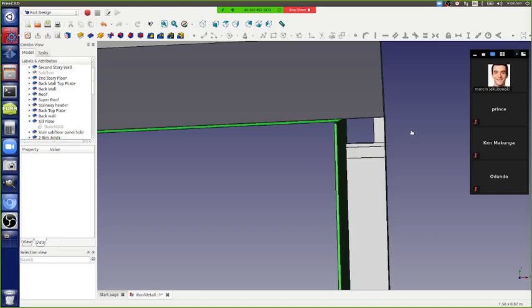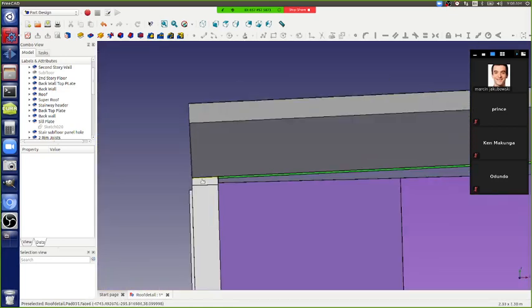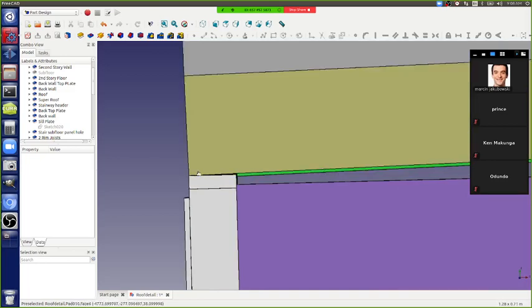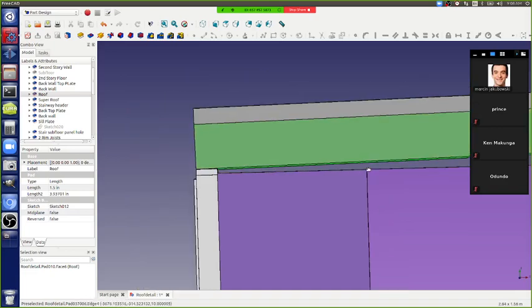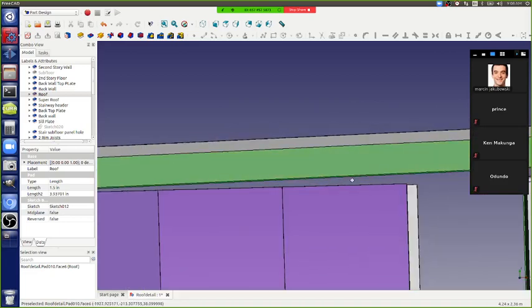This is actually a question for the structural engineer more, but I think structurally, that is good if you are fixed. For example, if you're fixed here, my analysis of this is this. We're fixed at the front. We have hurricane straps connecting on every joist to the structure here. You've got plywood at the front and back. There's no way that you can, well, it's very hard for it because you also have plywood on the side. You pretty much stabilize the entire roof.